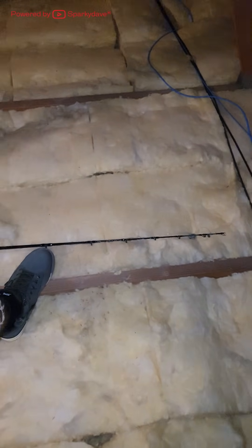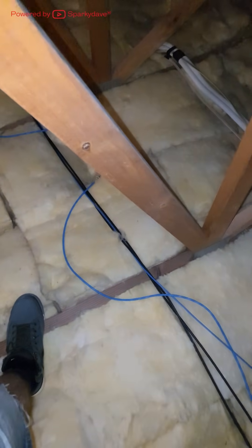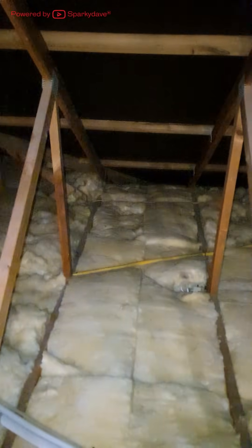When I'm talking about standing on materials, I'm also talking about not putting any body weight whatsoever on them — that is the same if you're crawling around in the roof space. A good way to get into tight spots is by putting a plank across two trusses and sliding it along until you can get right into the corner. Cheers for watching!